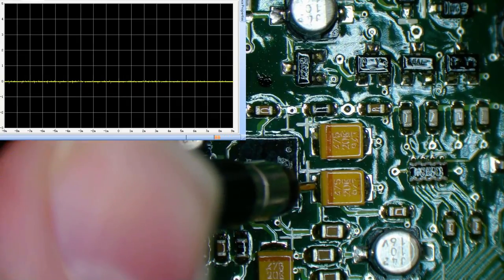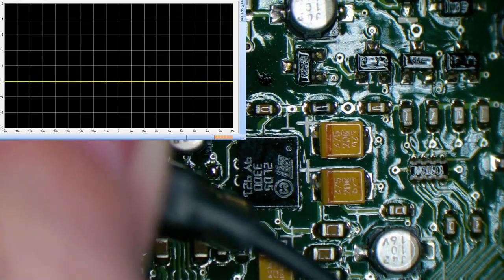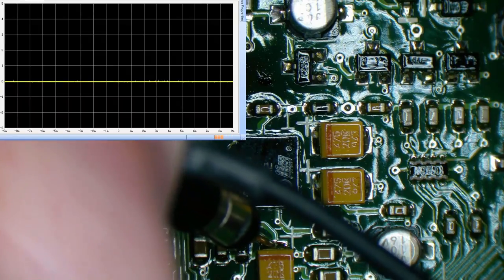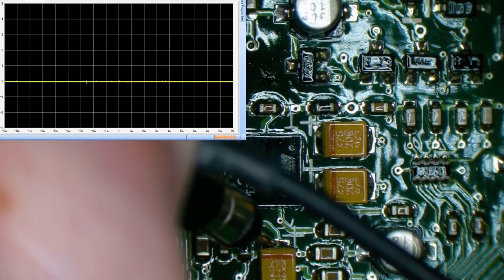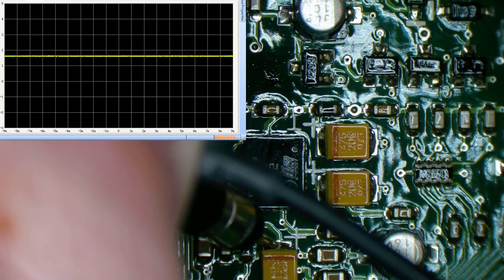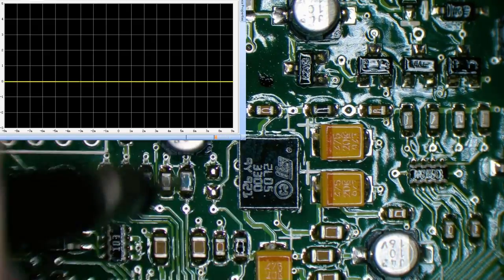Do we have some kind of voltage out on this capacitor? And we've got just over 3.3. And do we have a voltage on this cap at the bottom? And has my scope frozen? I think it did. Let me just try that again. Make sure we dig through that conformal coating. And we've got 1.8, it looks like. All right. So we know that that's all working.